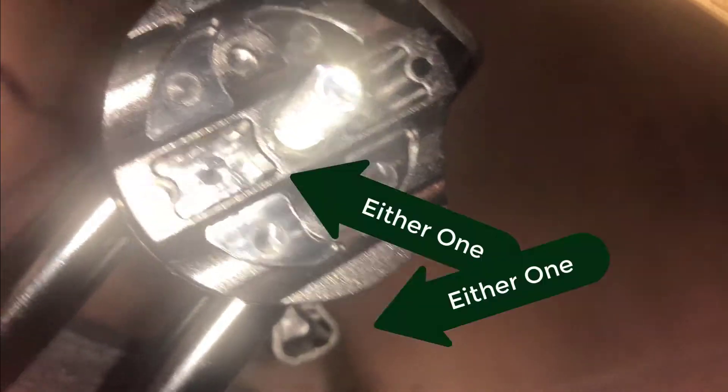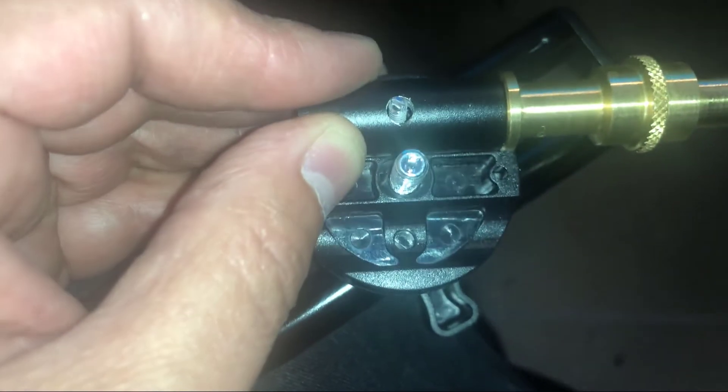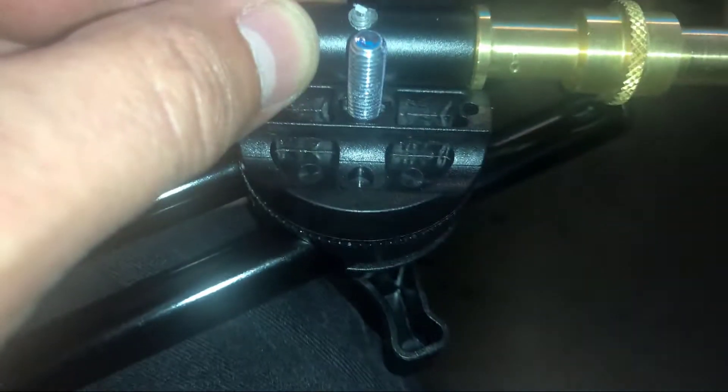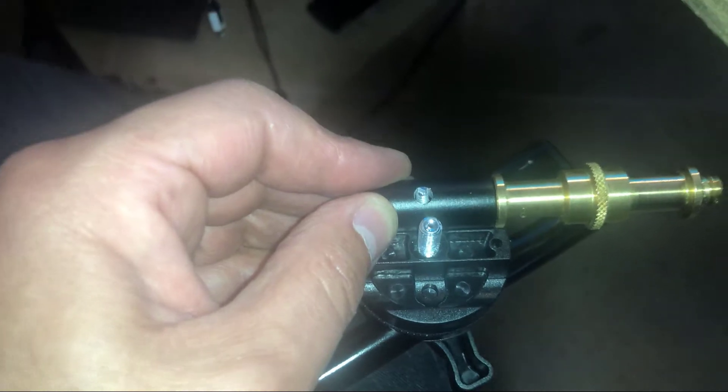When I push that through there, that pin is going to end up going inside that center hole right there, which is going to stop it from slipping out once it's tightened up. Mounted into position, it looks like that — that shear pin goes right into that hole on the other side. And now I'm going to put the cap on and tighten it up.